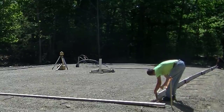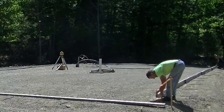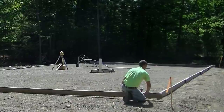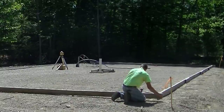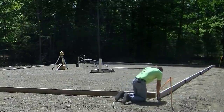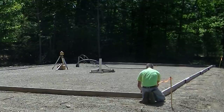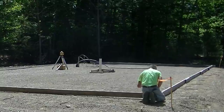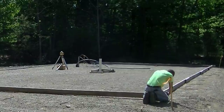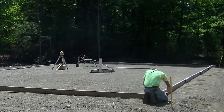What I'm doing now is getting my 58 foot mark measured out, then I'll mark that with a pencil so I can get that first corner screwed together right where I need it, then move down the 28 foot side and continue around. And you can see right there — the height of those two boards — there's a little difference in the gravel grade already. Either that corner of the gravel is a little bit low, or there's a hump in the middle of that form on the left. That we'll have to deal with when we set the forms to grade.